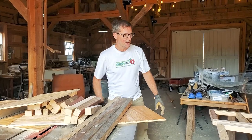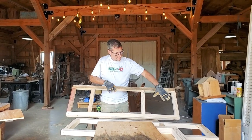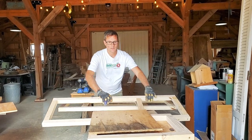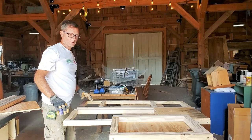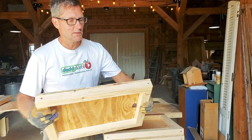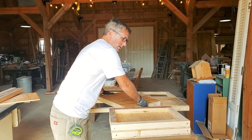Over here on this table you can see how some of these are coming together. This is going to be the front piece — these are two of those 48-inch pieces and four of those 12-inch pieces. This is the front left corner, the sandbox area, and the main door. The back side will have wire, and this is the back side of that sandbox area. So a piece of plywood will go on here, and we're going to have three rectangles constructed with plywood — two 21-inch pieces and two 12-inch pieces. All of these are constructed simply with one screw in the ends, and then when the plywood goes on I just snap it with some staples using the pneumatic stapler.